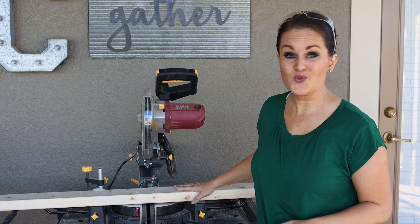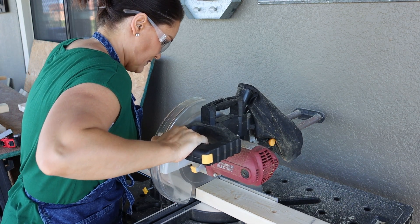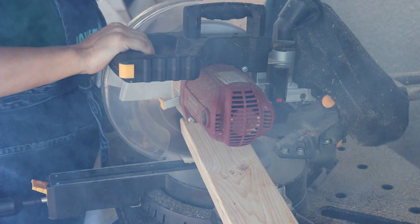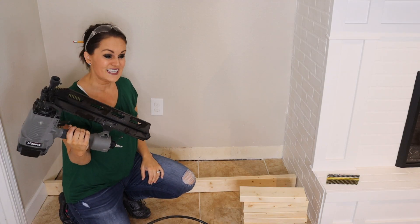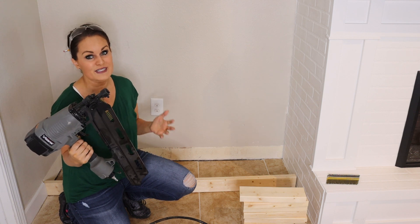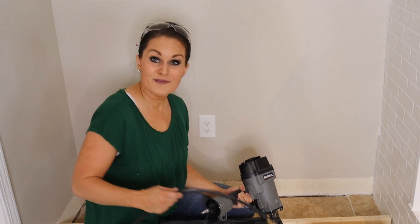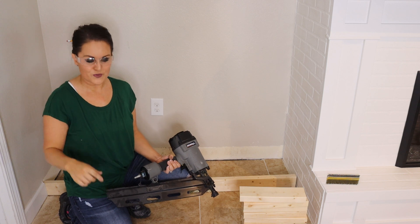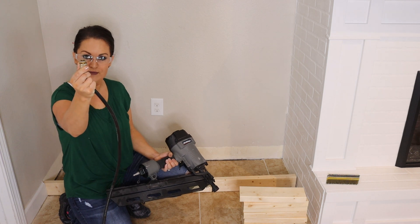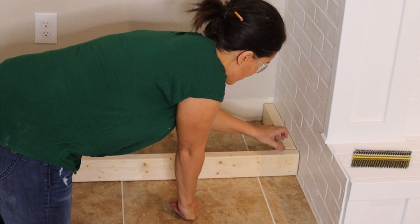Now we're going to build the frame. I've got some regular two-by-fours — we need it to be 15 inches deep and 59 and one-eighth inches wide. These are straight cuts, so we'll measure, make a bunch of cuts, and then go inside and use our nail gun to put it all together. We're using a framing nailer — a serious nail gun. If you're intimidated, go ahead and use a drill and some screws, but nails are typically stronger than screws. Put on eye protection, attach to the air compressor, and we've got a powered nail gun.